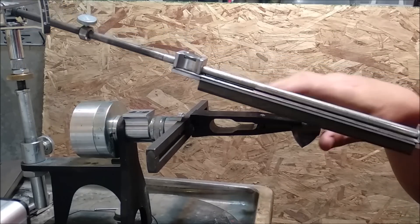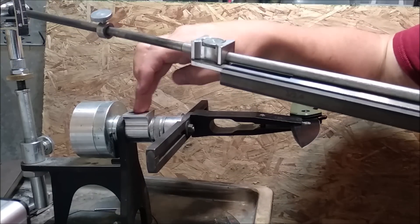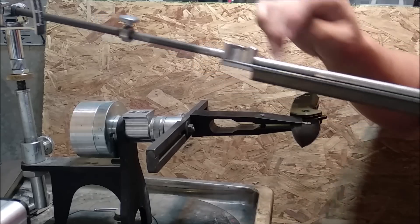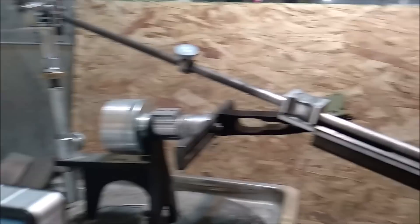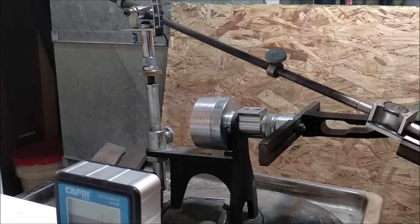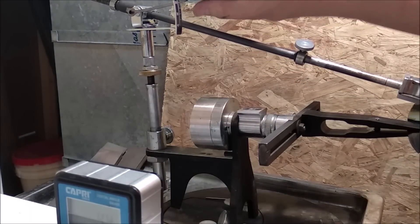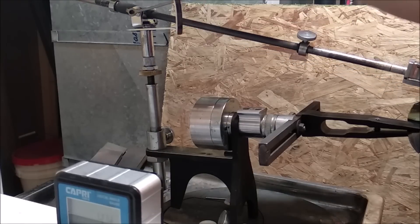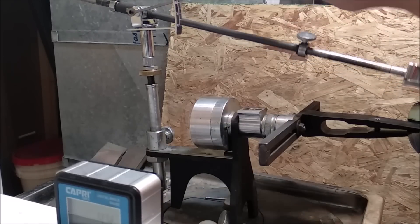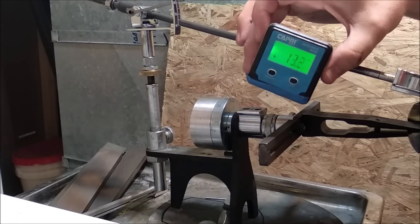I could have done this on my Hapstone sharpening system — anything where you've got a stable way to find an angle works. I don't trust the angle finder built into the system right here, because this pin could move easily, it could be changed, this whole thing could bend up and down. So I totally ignore that and always use a proper digital angle finder.